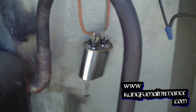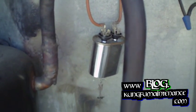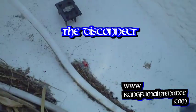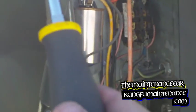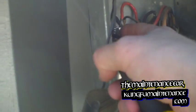I've got a video showing how to secure the fan capacitor so you can check that out to make things a little safer. I wanted to show you how to get this going if your compressor was overheated. I've already pulled the disconnect — as you can see back here, there's the disconnect. Fuses are probably bad also. So now I'm going to go ahead and discharge the capacitor. The capacitor holds a charge even after the power is disconnected. Holding my insulated screwdriver, I'm going to bridge the leads to the capacitor and discharge any charge that's still held in there.